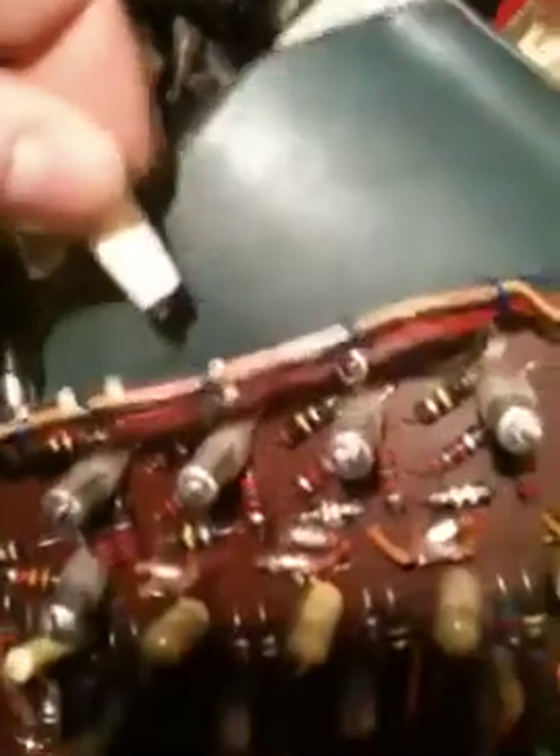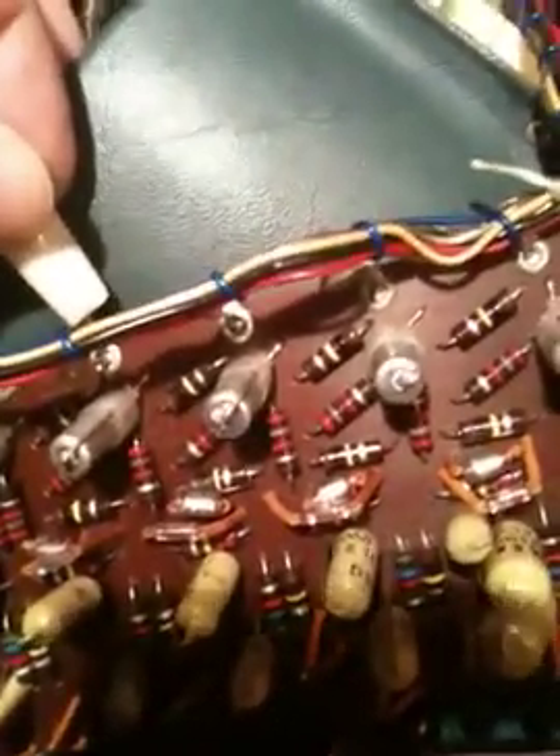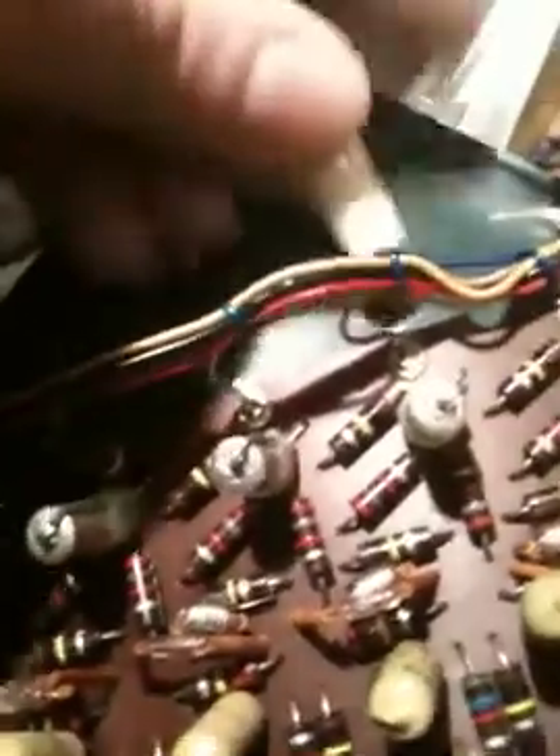You can hear that. Then the next one is that frequency divided by two. So you can hear that's half the frequency, and the third one along is that again divided by two — so the next octave down. And then another tag down — it's a bit flaky because I'm trying to do this with all the cabling still in place. And then that's that one, and then you'll hear it divide by two again. And then finally the last one, which is the lowest note.